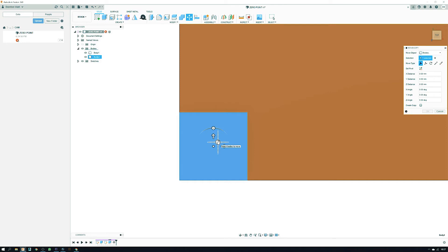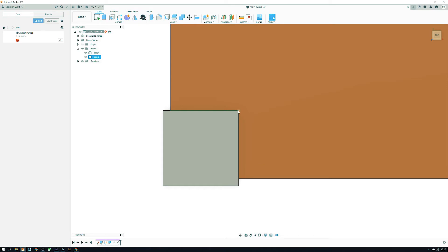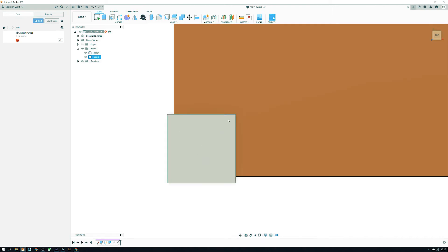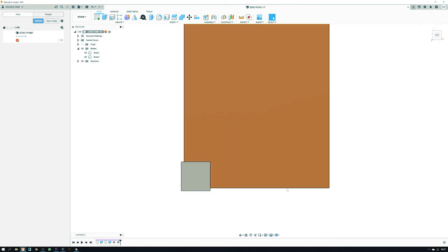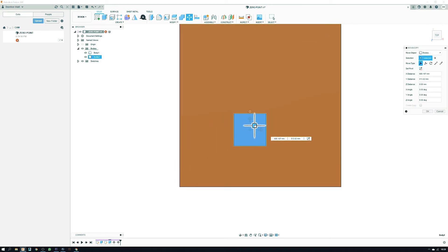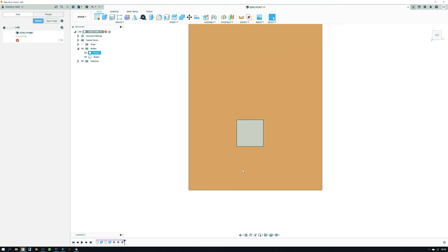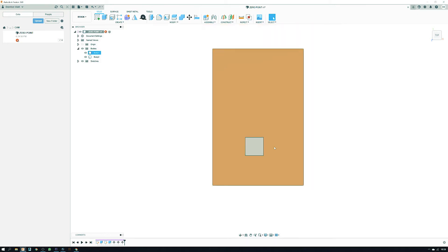If for some reason I took it slightly off and zeroed this corner 380 by 380 millimeters in, my left-hand side would overlap the limitation of the machinable space and it would throw out an error when it reaches that point because the material is not within the machine's parameters. But if I placed it anywhere else on the machine within my limitation, I could machine it from every corner and it would be fine.